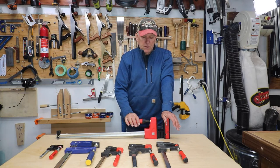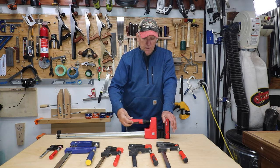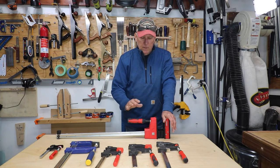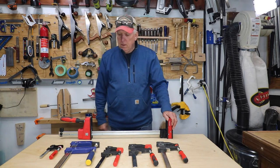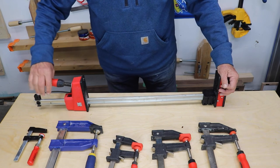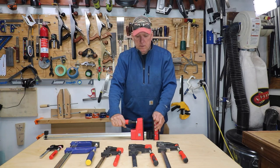Step number one to have a good relationship with your big Bessey panel clamp: when you want to use it, turn it counterclockwise as far as you can. What happens when you turn it counterclockwise is you're putting the silver part of the brake further into the head, and you have more capability. If you want to make the opening wider, pull up and move. If you want to close it back up, it's just the opposite — don't pull up. If you want it to become more narrow, just make this area more narrow, and there you have how to have a decent relationship with your basic workshop clamps.